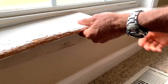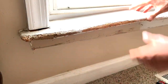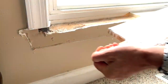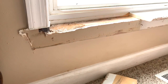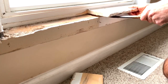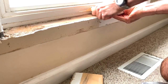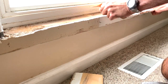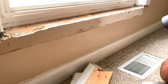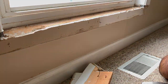Just work these out one at a time. Be careful when you're doing this — if you pull that window sill the wrong way, the ear that's sticking out to the left there will dig into the drywall and make a big hole there. Just clean up the mess right there and take care of any nails that might be sticking up.